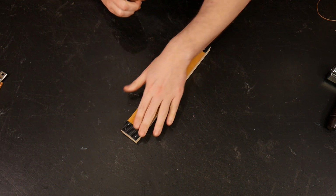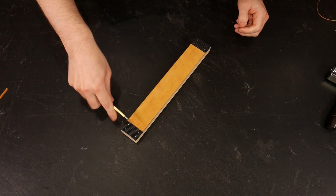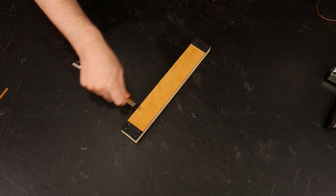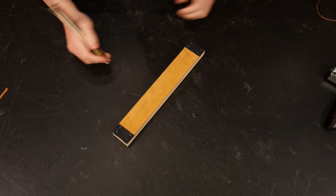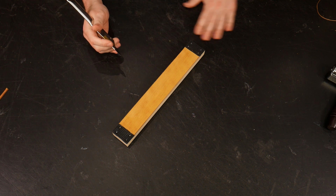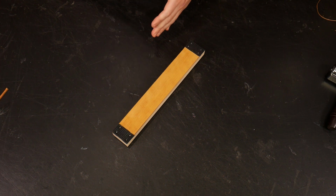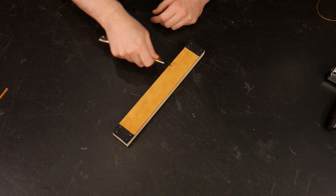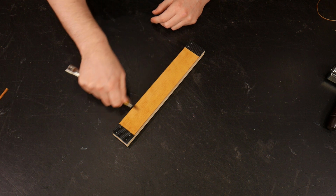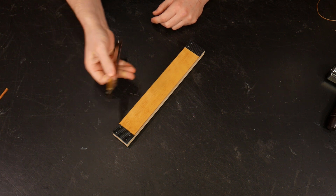Now, if ever you start to lose that sharpness with your knife, and you strop it again, if you're using a strop with, say, 3 microns of abrasive particles in there, that's great for putting a polish on there. But if you've gone over a bit of grit or something like that that's impregnated into your work surface, and work surfaces do get grit in them from time to time, especially if you sand over them, that happens. No amount of polishing is really going to get rid of that. What you want to do is use a fine abrasive just to re-profile that edge for a few swipes, and then do a little bit of polishing on the edge of your blade.